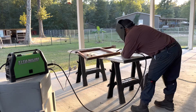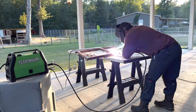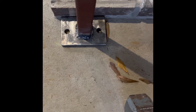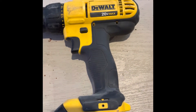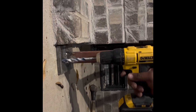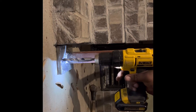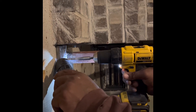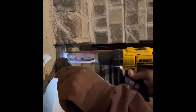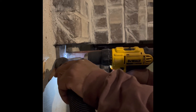I'm gonna anchor these in the ground, and this is what I'm going to use — these anchor bolts. I went and bought a half-inch drill bit and I'm going to use my drill. Another tip: I normally drill a little bit first to make a starter hole, then I use my shop vac to help suck out all the dust from the hole — turn it on and suck up all the concrete dust while I'm drilling. This is a half-inch concrete bit I bought — works every time.